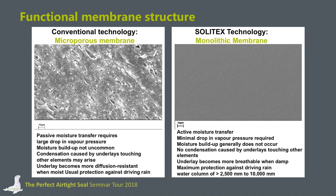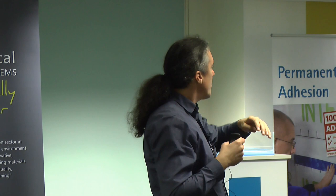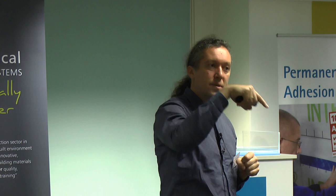The Solitex technology is completely different because we use a special plastic that is diffusion-open by itself — so there are no pores in the Solitex function film. We achieve very high rain resistance; it is very watertight against driving rain and very open to diffusion at the same time. This closed-cell monolithic membrane between two spun-bond layers offers the advantage that even if covered with water, it still allows vapor to pass and dry out the construction.